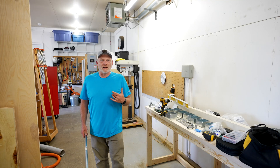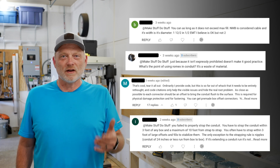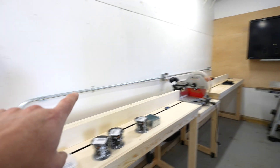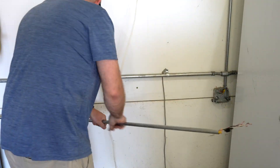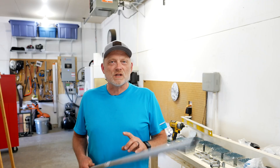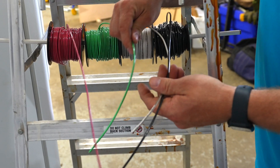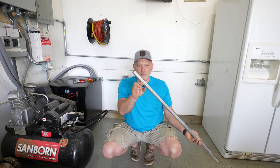So what does brutal honesty have to do with it? I already did this video, or I thought I did, but I had a lot of comments with good feedback that I thought I would incorporate into a redo. I'm relocating outlets because I'm putting a French cleat wall up in the garage, and I needed to lower the outlets, so I'm pulling everything back all the way to the breaker box and rerunning it using 3/4 inch conduit and THHN wire. We're going to do this the right way. I'll show you tips I learned from the previous video and also some of the mistakes that I made. So stay tuned and let's get going.